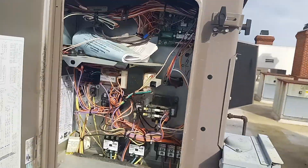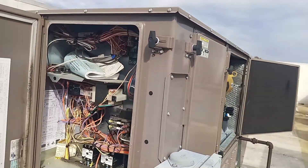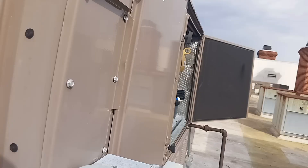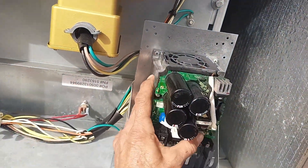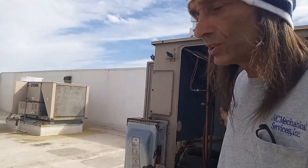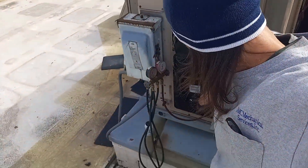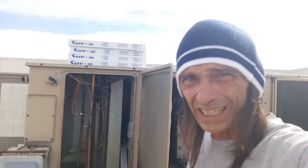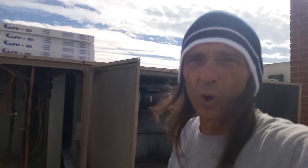This is a newer style unit, just a few years newer. I'm going to make a little side note about this one - these VFD controllers, don't worry about that, it's not even hooked up. I'll show you that in a minute. But if you don't go around and check all the error codes and all you do is check the heat, you may miss one that's giving you a code telling you that a compressor is entirely out of charge. I love finding those because it shouldn't take more than about 10 minutes to locate the leak - but more on that later.